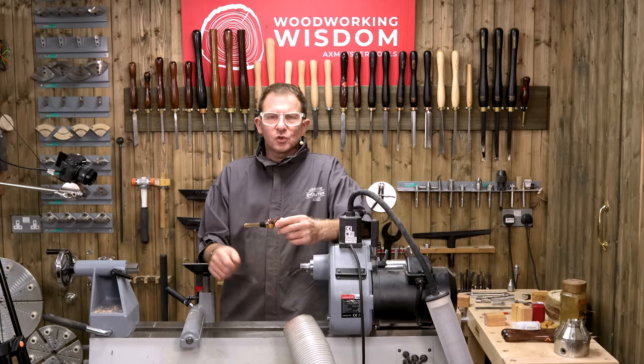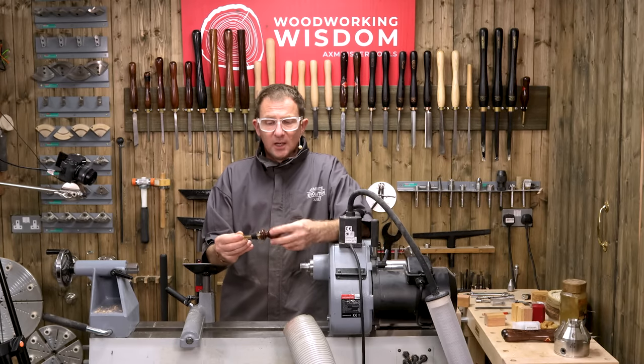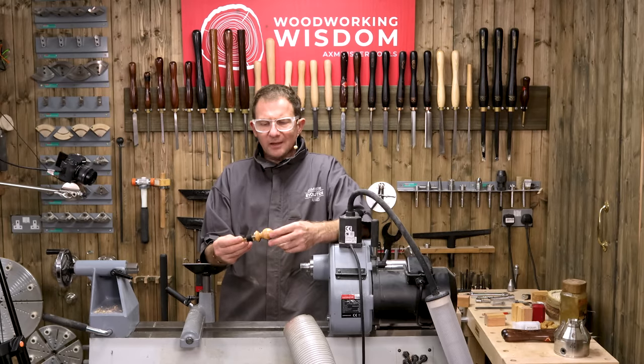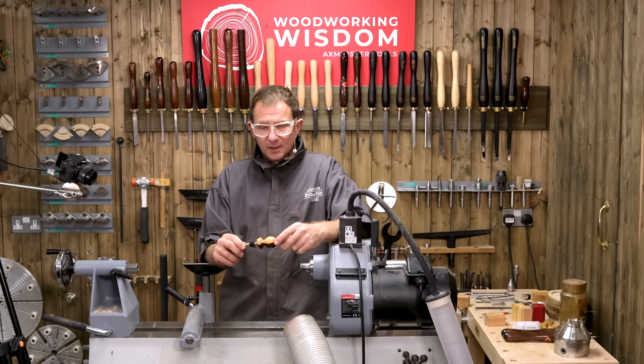I've had them so they won't join together nicely. You get a gap. So this part screws on. We'll show you a bit closer in a minute. I've got my hole the wrong size, so actually strip the thread out. I can glue them in. So there's different things we can look at. A few techniques and tips along the way that hopefully will help you make a simple bottle stopper.